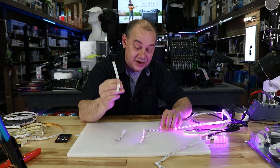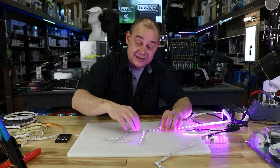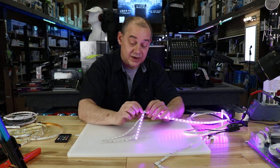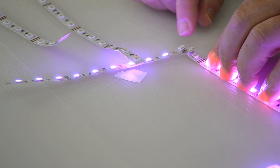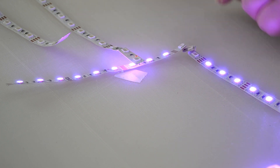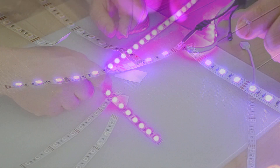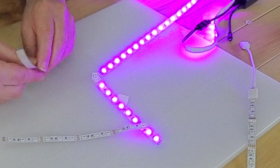This is the reality — this is the type of videos we're going to show you. If it goes bad, I'm going to let you know. You do need to test and check to make sure this works. These lights went out and I'd like them to stay that way — I don't want them partially on or changing color. There are two power leads that run through the whole thing, and every three lights there's a little tap that feeds that section. You can cut down to a three-light section.